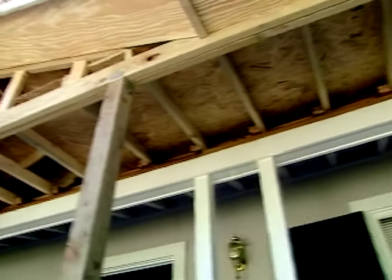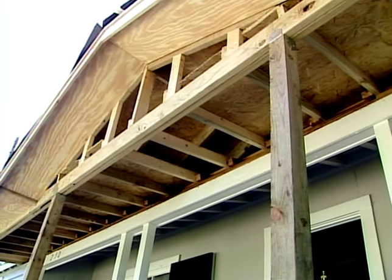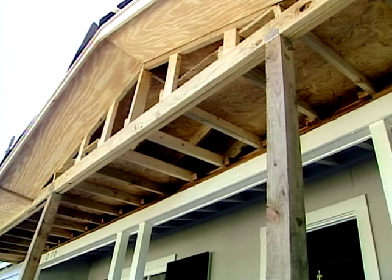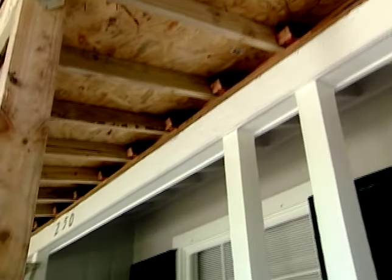That'll look fine. In our rafter, our tie-in, we had these old 3x4-inch rafters, which is really kind of an odd size. We had talked about, do they go all the way through the house or is it just on the porch? I'm not really sure. But our 2x4s tie into them and extend a couple feet or so with the support under the header.